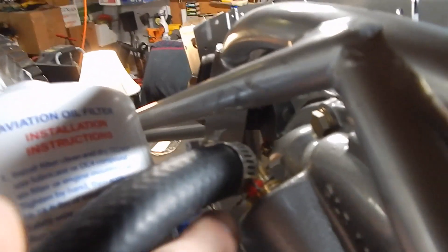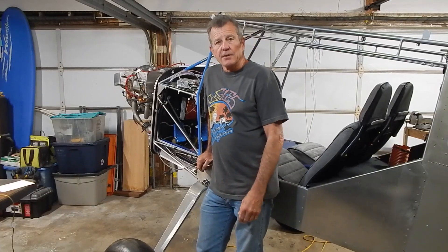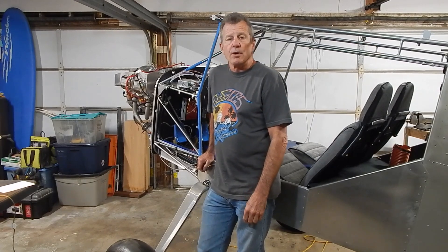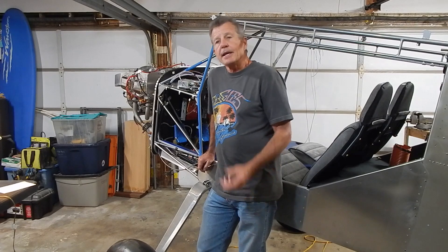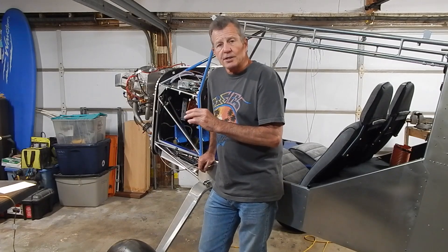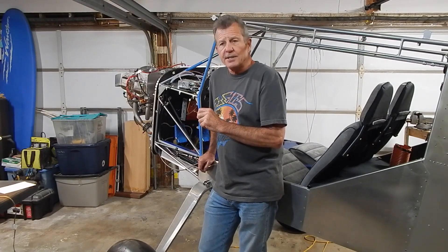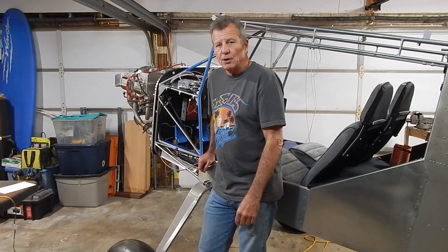I forgot to mention that this fitting has what I think is an oil pressure adjustment. It was wire-tied to the old fitting, so you've got to cut that wire tie to get the fitting out, and then rewire-tie this fitting onto the new fitting up here — don't forget to do that. Well, that's a good place to end the video. That section of the build took 18.6 hours, bringing the build total to 1,115.3 hours. In the next video, we'll get started on the exhaust system, the heat exchanger, and maybe the exhaust gas temperature and cylinder head temperature sensors. Thanks a lot for watching, and remember: dream it, just build it!